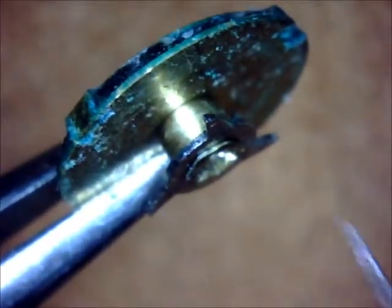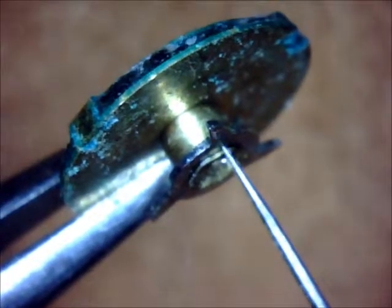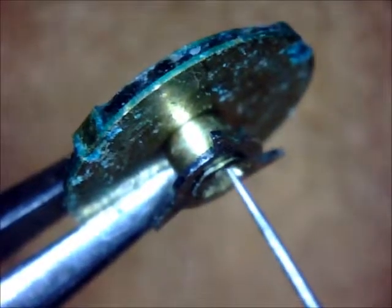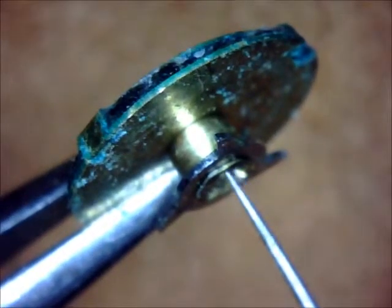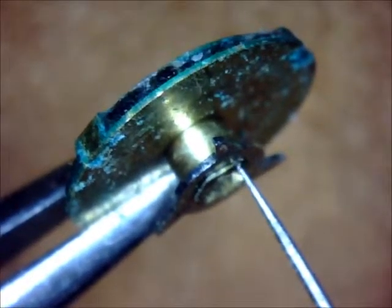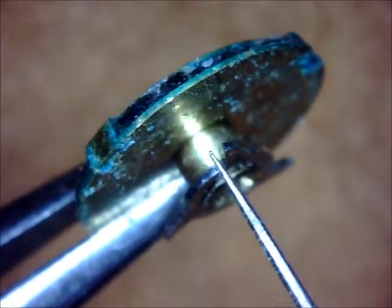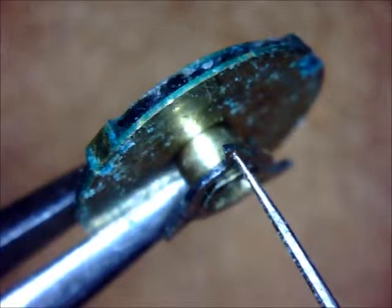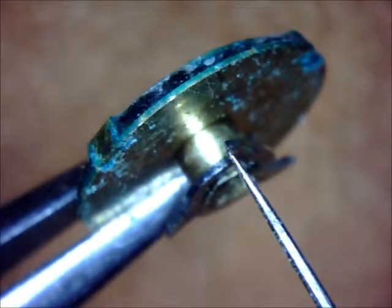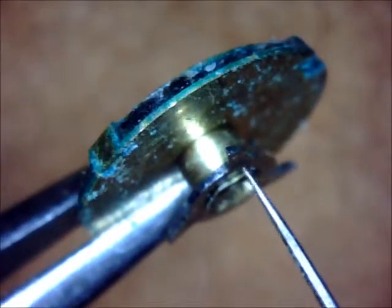The star wheel is crimped — a light crimp on the end of this shaft — and it has to be timed exactly like it is. So you have to mark it and put it back. This shaft in the center right here is one piece that goes all the way through to the back side. This can be taken apart with your staking tool.